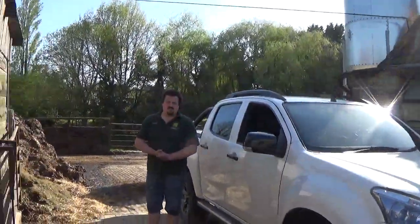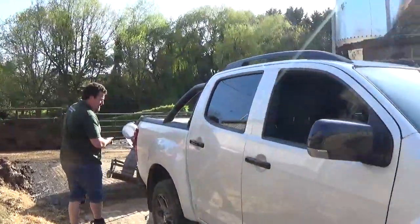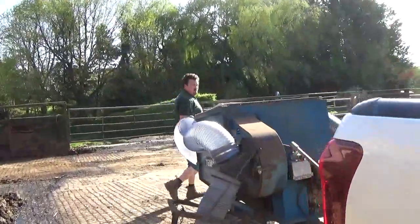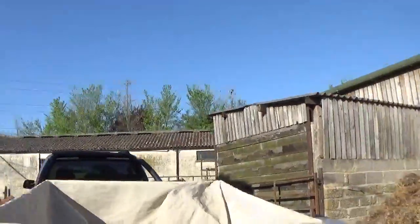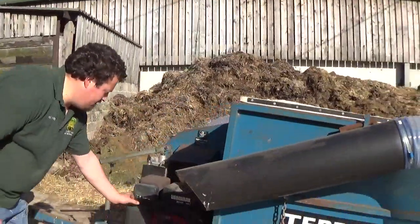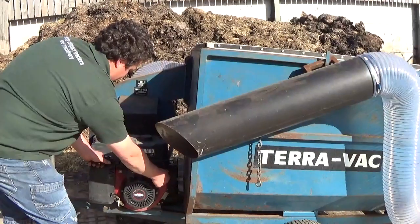Okay, so we're now in position. I'm going to show you how to start it. I'll show you a bit running. We're going to have a go at picking up some debris. If you'd like to follow me, go back round to the other side of the machine where all the controls are. Right, so first I'm going to make sure my choke is on. I'm going to give it a little bit of throttle. I'm going to turn my ignition on and then I'm going to start it.